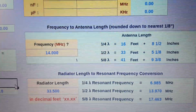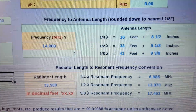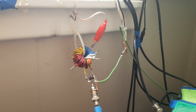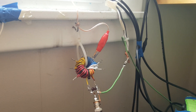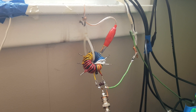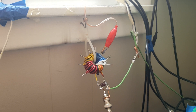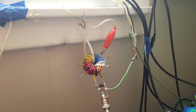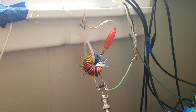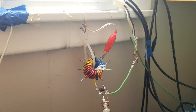What I got was a resonant frequency of 12.467 megahertz, so the wire was too long, as I knew it would be. I started on the 49-to-1 tap and swept it with my analyzer, looking for two things: the resonant frequency and the standing wave ratio. I got an SWR of 1.5-to-1 at 12.46 megahertz. So I knew the wire was too long, and that was not the correct tap to use — I could do better.